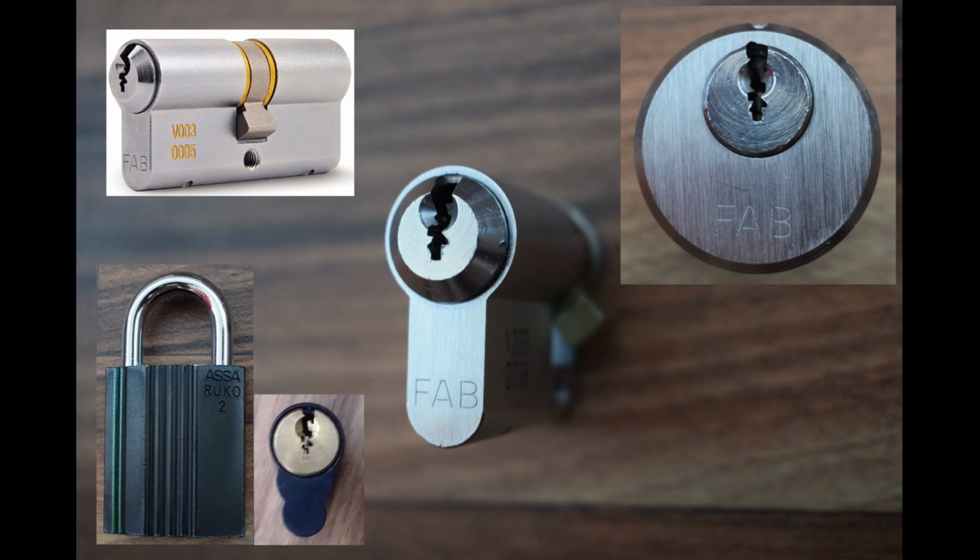The price was high and there were problems with some security fittings because of the core extension out of the cylinder body. Also, to support it was not all that easy for locksmiths. Keys had to be cut on an expensive CNC machine, key blanks were very strictly guarded, and each cut key had to be measured and all deviations had to be logged. The result was that the lock was discontinued, and now it also is one of the rarest FAB locks.